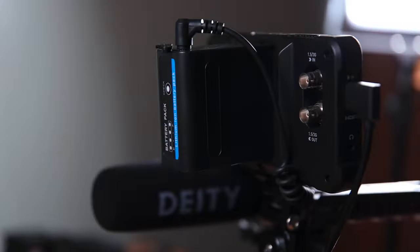The first problem is battery life. I really do love these Power Extra multifunctional batteries — you've got a USB at the bottom and a DC at the top, and the DC is what I use to run to a dummy battery to the Pocket 6K. I can get about an hour and a half to two hours off of one battery, turning the camera off between takes. I have five of these and I use all of them on an eight-hour wedding day, and a lot of times I'm already starting to recharge them.